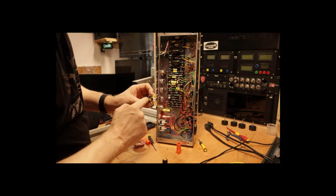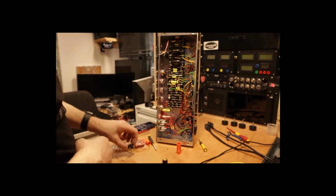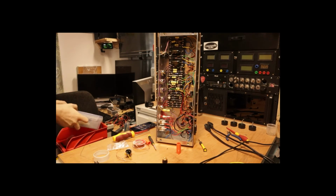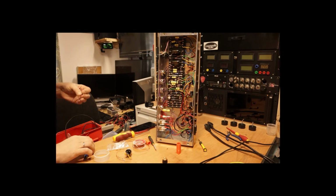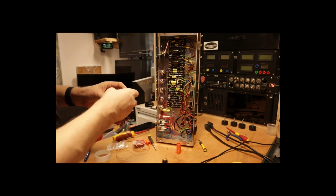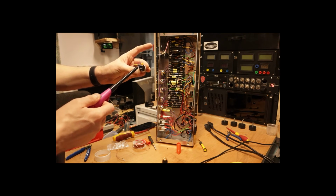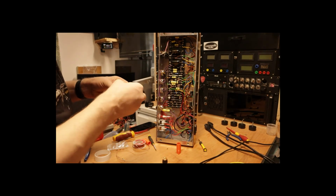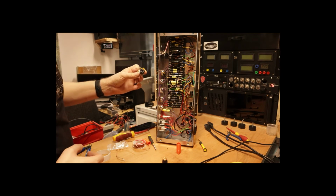The capacitor is physically attached very closely to one lug of the switch, so it'll be fine. But this can sort of move around a little bit, and just belt and braces, I'm going to heat shrink that connection just in case. It doesn't do any harm, and it can avoid issues later on. As it's a small piece of heat shrink on the back of a switch, it won't be seen. I'm just going to use a firelighter to heat the heat shrink rather than firing up the hot air workstation, and then that wire can go through to the normal potentiometer tabs.